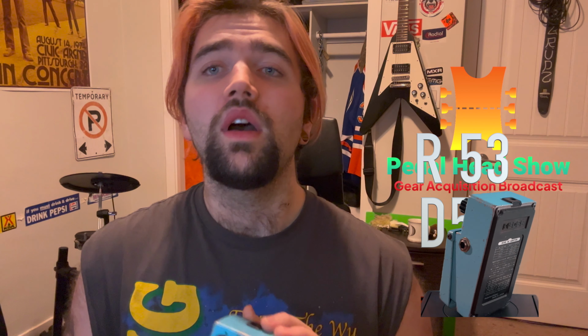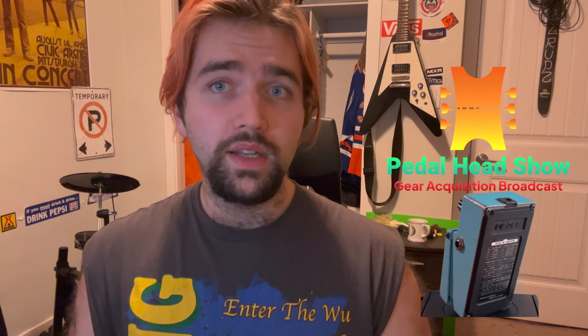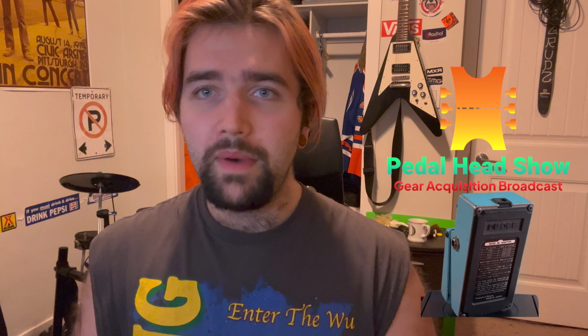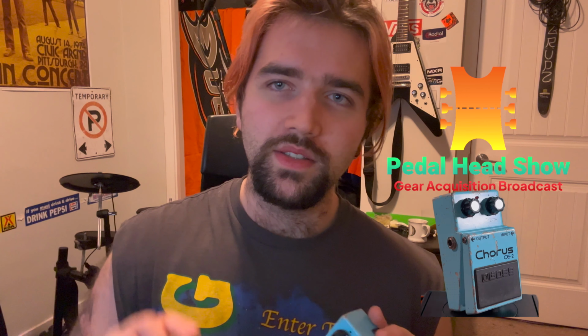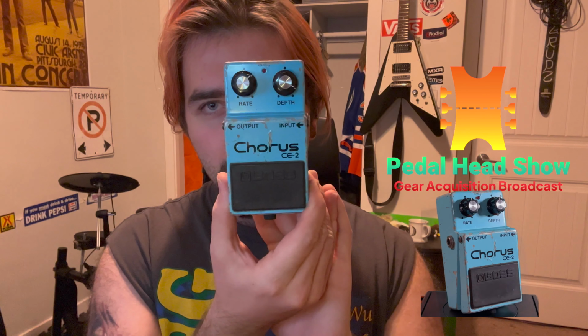So I'll leave a link in the description of another guy who modded a vintage Boss CE-2 to be true bypass and work with a PSA adapter. And we all know that PSA adapter means 9 volts. And there he explains which points to solder a jumper in order to make the Boss CE-2 work with 9 volts. Okay, that's all.